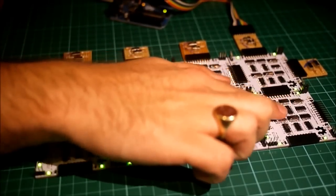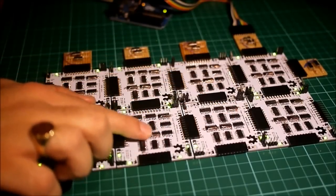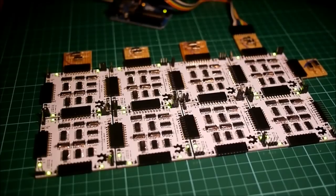These four slices act as comparators. Each one compares the two inputs — the stored one from the register and the current input — and outputs a 1 to the next comparator if and only if they match, and they got a 1 from the comparator above them. This LED here will be lit only if the entered combination is correct.